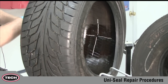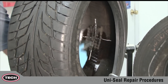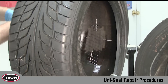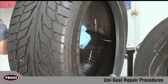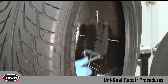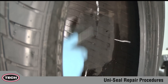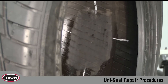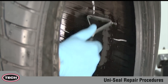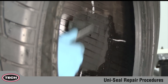After removing the inspection tool, pre-clean a large area of the inner liner by applying Tech 704 Rub-O-Matic Rubber Cleaner. While the area is still moist, use a rubber scraper to remove contaminating substances. This process should be repeated two or three times to guarantee complete removal of contaminants, such as silicone mold lubricants used in the tire's manufacturing process. The important thing to remember is that the area must be cleaned.